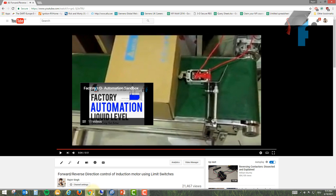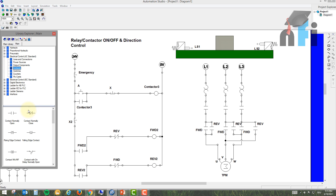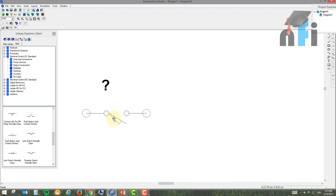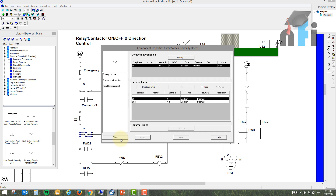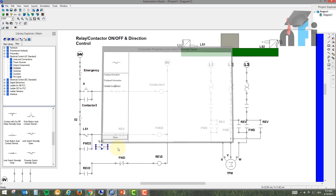So how do we make the circuit for that? I've copy-pasted the last circuit and renamed the conductors. We've removed the push buttons and replaced them with two limit switches. We'll use normally open limit switch contacts — the symbol indicates it's a limit switch, not a normal switch. Connect one switch tagged as LS1 and another tagged as LS2.